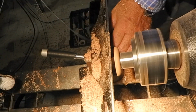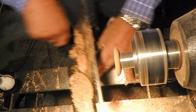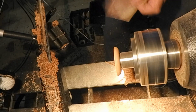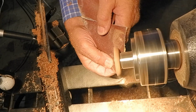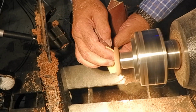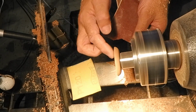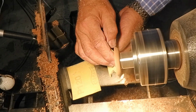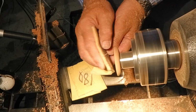So that's good there. And your question there now, Kai. I have access to all the parts that haven't been sanded. I can go in almost up to the jaws and sand the outside, sand the inside. I always break the edge off the outside because when you come in with a bowl gouge, the edge of this little cup tends to be really, really sharp.